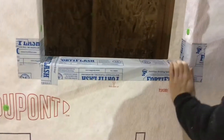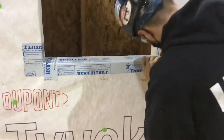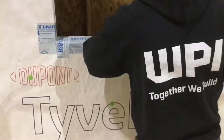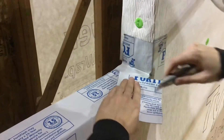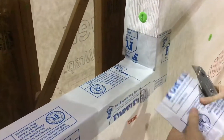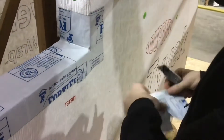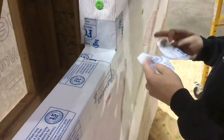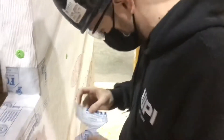You should be able to see here as I zoom in — the corner on the right was trimmed a little bit too far, so it reveals a little pinhole, and that's the weak point of this system. So by doing this next step, called a bow tie, you're stretching that piece into that corner and causing it to fill that weak point.